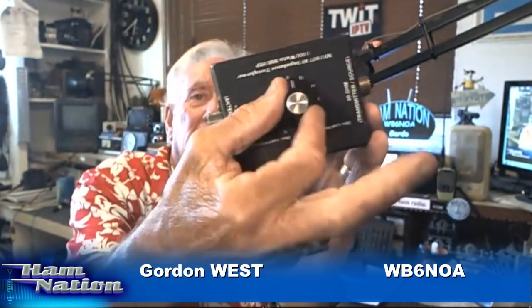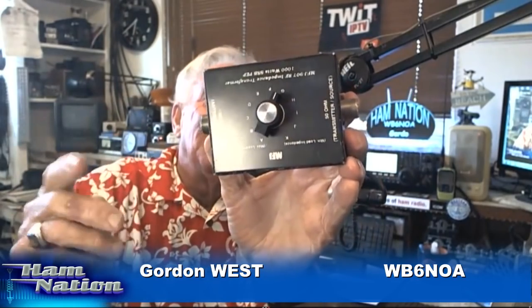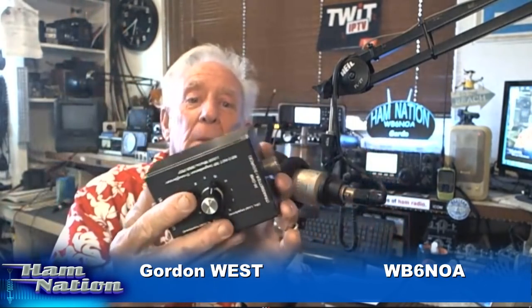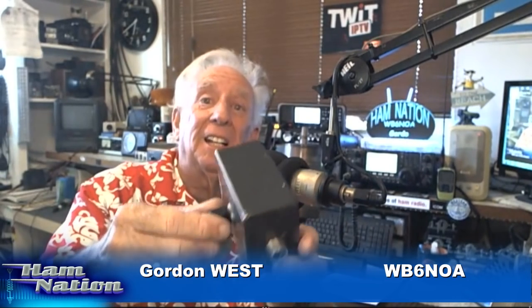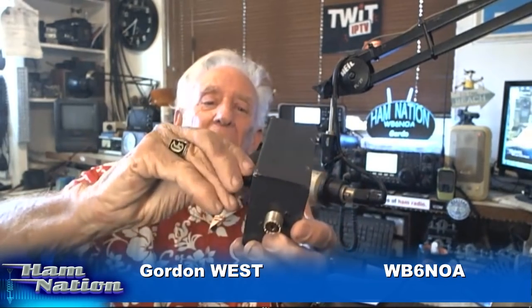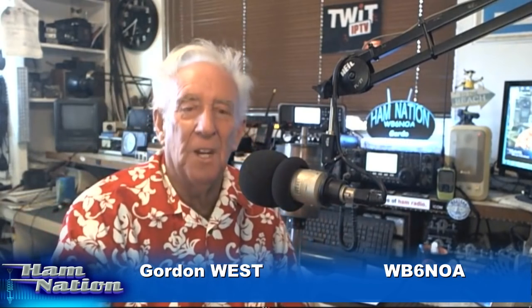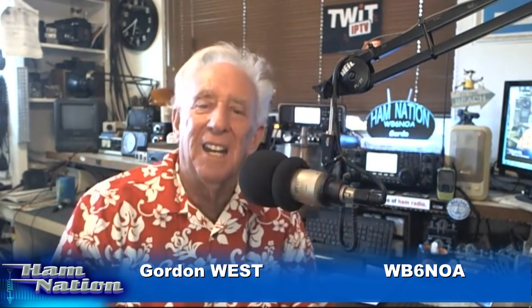And on the front, I go to 40 meters and I go click, click, click until I find, oh my gosh, the noise came way up. Now I put on my SWR analyzer and take a look. Caution, especially with the MFJ design, as with any design that has click, click, click switches, do not try to run 80 watts and start clicking through there, because you'll notice that smoke will be coming out the back. You never hot transmit on an antenna switcher that you're switching.